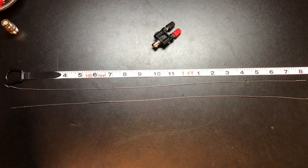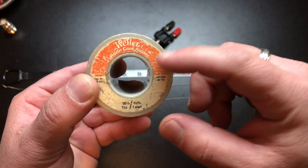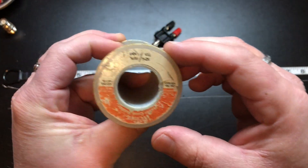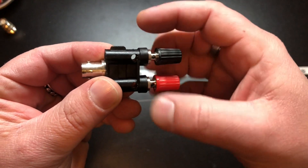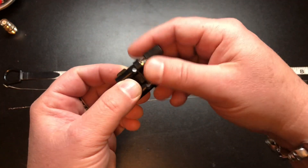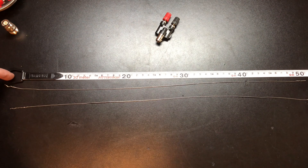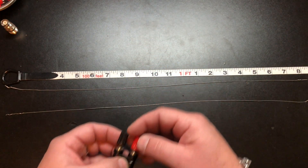We don't really need many parts. I'm using some 60-40 solder from Weller, rosin core — that's very important. If it's going to melt, you definitely want flux to make sure you have a solid connection while you're keying up. I've literally had this roll of solder since high school, so that was definitely only two years ago for sure. We've got one of these little BNC to banana plug jobbies — that's how we're going to connect our radiator and counterpoise. Just a half-wave dipole for two meters, so about 20 inches — one foot eight, about 51 centimeters for those of you across the pond and the rest of the world. This is so stupid.